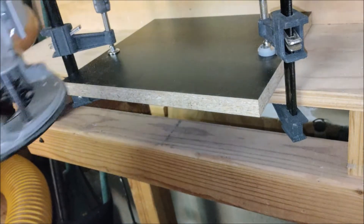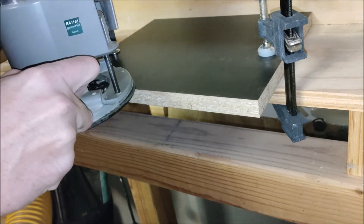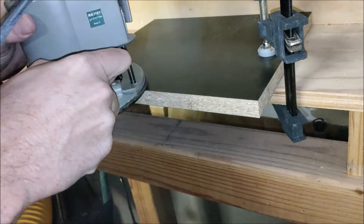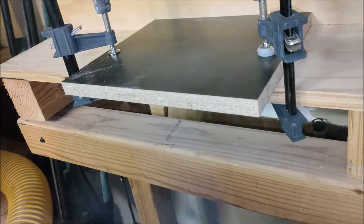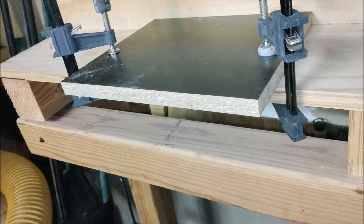The concern is if you're using plywood — depending on where you buy it, you might wind up having a variable thickness. You may want to measure and cut in multiple places. So I measure out where the cutter bit should go first and make my first cut.